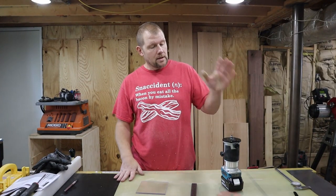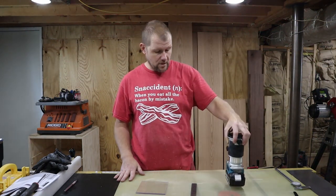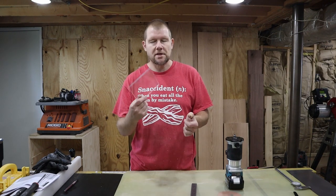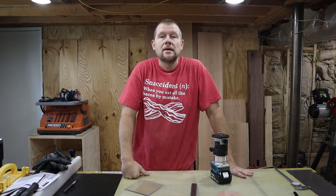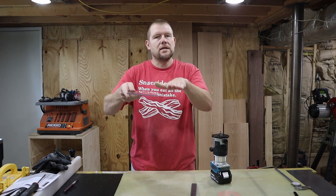We're in the shop. Last week I showed you that I got my new router, and at the end of the video I told you that I like to have a larger base on my router, which is what we're going to do today. So here's our new base — a piece of quarter-inch thick Lexan acrylic, plexiglass. We're going to fit this on there to give a slightly larger base to work with, which will make it a little bit safer and more stable.